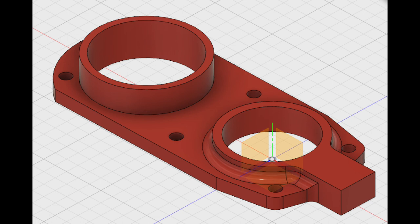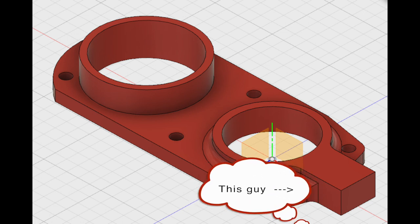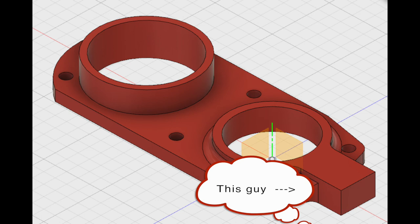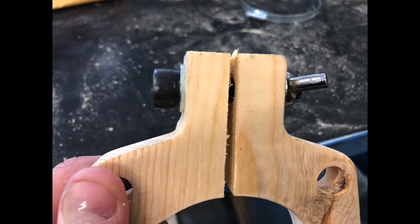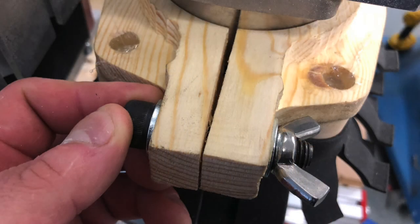I went into the Fusion 360 model and modified it to add a lug around that bore where the spindle is inserted. I went back afterwards and used a band saw to slit the lug so there was a relief between the two lug halves. I drilled a hole through the lug and used a socket head cap screw and wing nut to clamp up the joint. I also used two washers on both sides of the interface to protect the wood from being compressed. It's a fairly large diameter fastener with a good-size wing nut, which makes it easy to tighten and loosen without any tools.